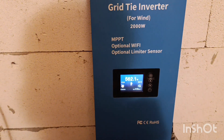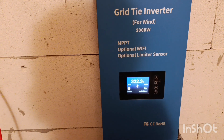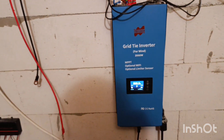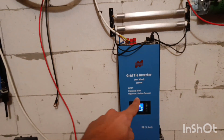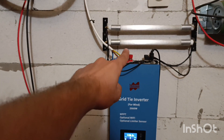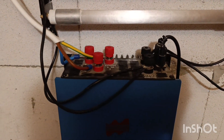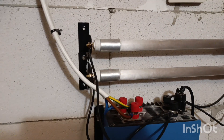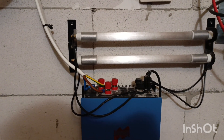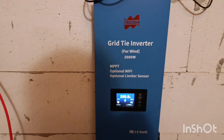Hey guys, Saturday evening September 14th and we have finally got some nice wind. The FT 2000-2, 3.2 meters in diameter, is currently sitting on this grid tie inverter with double resistors — one is 10 ohm and two of them in parallel, giving a total 5 ohm system resistance. That makes it work absolutely better and holds this crazy wind turbine as it should.